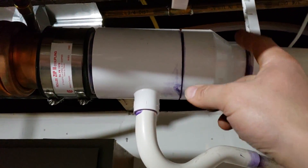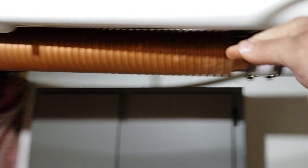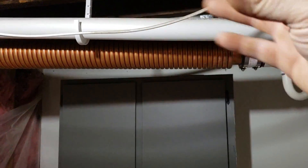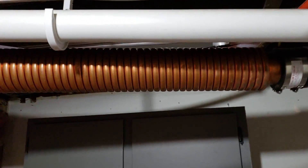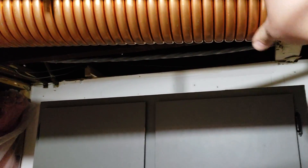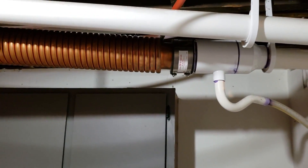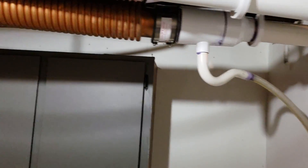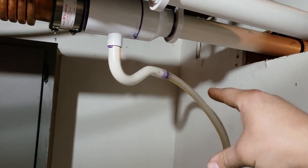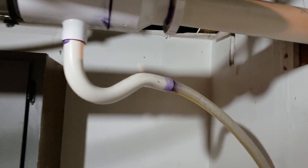I spliced in here with an upsizer to 3-inch. This has to slope back towards the boiler because there's condensation in the exhaust pipe, so it needs to flow back to the boiler. When you're dealing with exhaust gases in copper, it can create something caustic and corrosive. You don't want that going through your boiler heat exchanger or your furnace heat exchanger — you want to capture that condensation before it gets back there. So I put a P-trap in here, which basically holds the water line of condensation right here, and it flows out and then connects to my other condensate drain.